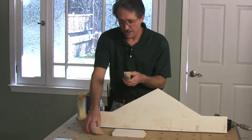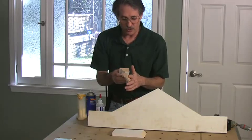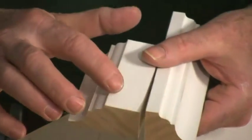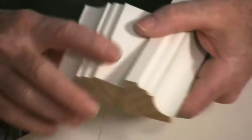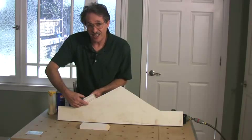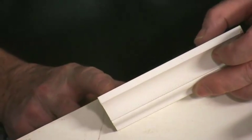This is Windsor One's Classical Craftsman cap — it's a really neat molding. I've ripped about an inch off the back of it so that we won't have this big wide fillet anymore. All we need is just a small fillet, about three-eighths or a half an inch. This wide fillet is designed so you can install it right on top of a pediment, but since we're going to put this cap right on top, we want this molding to sit right against the pediment. That's why I ripped it down.